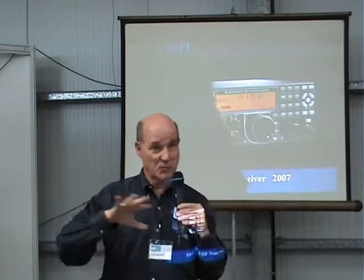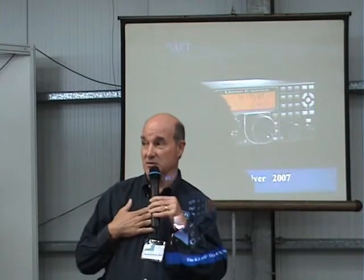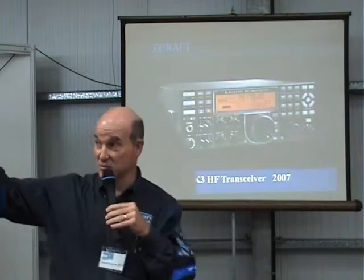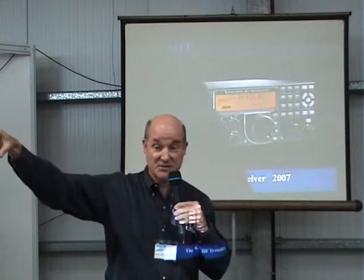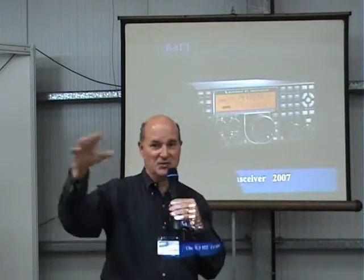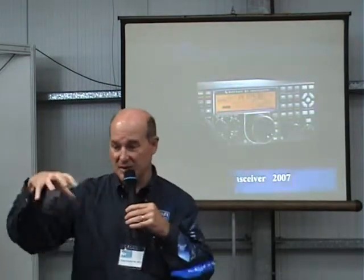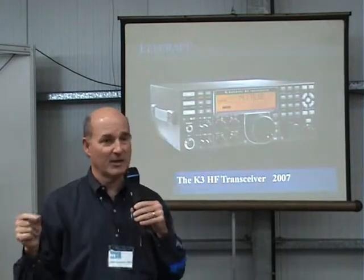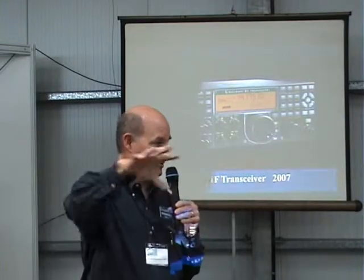But what we found is that about 20% of the crystal filters from INRAD that we tested with this test fixture we couldn't use, because we're supporting a higher dynamic range than the other radios were pushing it to. They just were not getting that strong of a signal. They would distort somewhere else in their receive chain before it even got to us. So we got them to sort out their stuff designed to our spec, and subsequently their manufacturer actually makes them better and better, but still to this day they sort all their incoming filters, and we get all the ones that meet our specs, and the other ones go into the Yaesu radios.